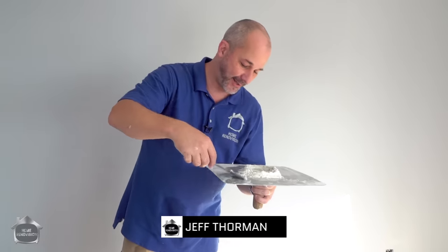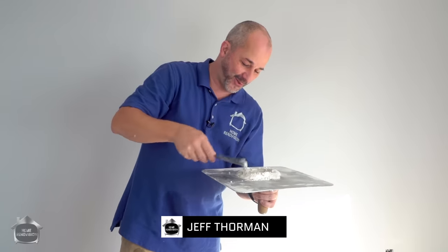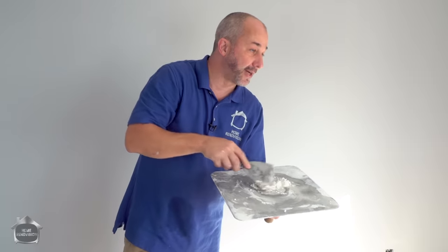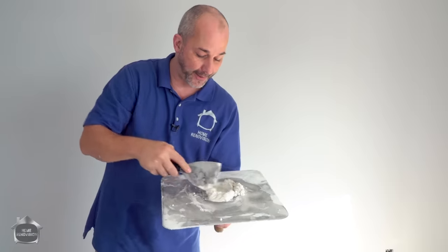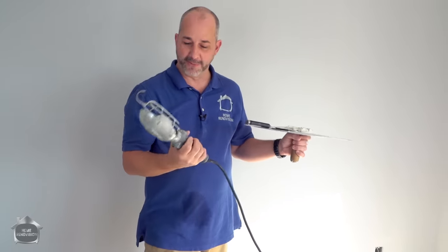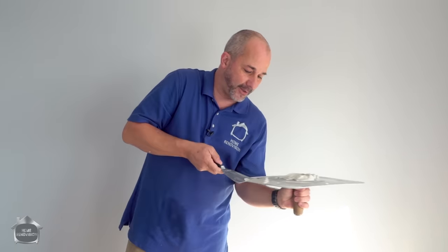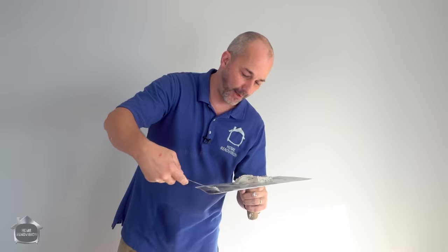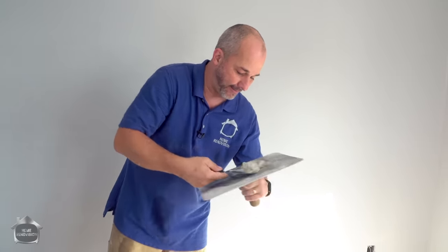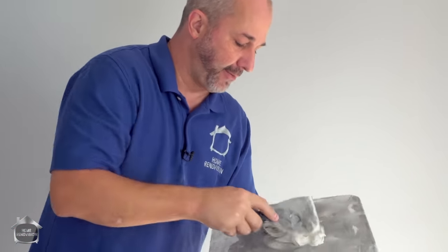Welcome back to my kitchen renovation. We've got a beautiful sunny morning here, so don't mind me. I'm just trying to get my quick set mud ready to go here. When I have this much sunshine beaming through a window, I take advantage of it for my prime check. Like, I was running around with this thing last night, you know, before I did my first coat of paint. And I came down here this morning, and lo and behold, the sunshine has revealed all kinds of sins on my wall. That sounds almost poetic, doesn't it? Here we go. So this is just 45-minute compound. I'm just using cold water, so I have a few minutes to actually work with it.